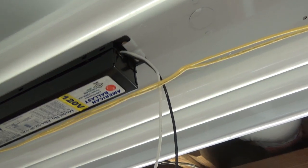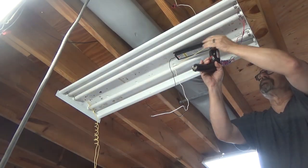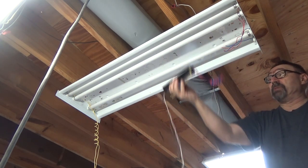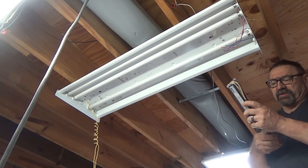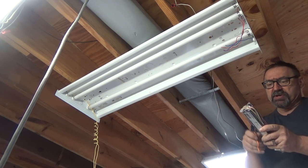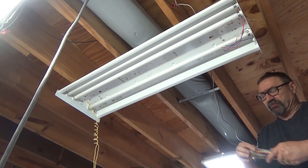So there's the slot — I'm going to cut the wires and take the old ballast out. The nut's off and the old ballast is out. Of course, it's a lot easier to get an exact replacement — same model number. It doesn't have to be the same manufacturer, but that way it'll fit right back up.